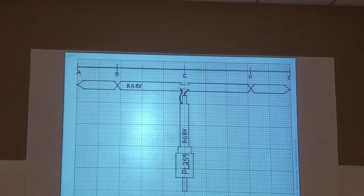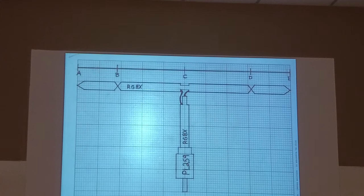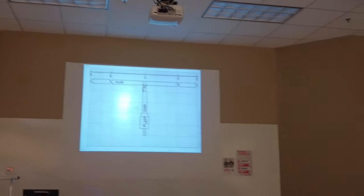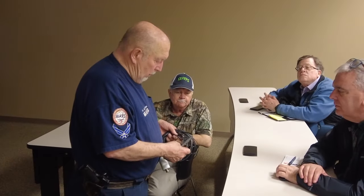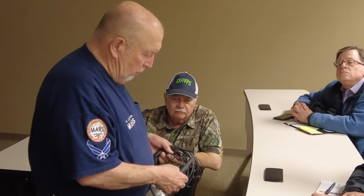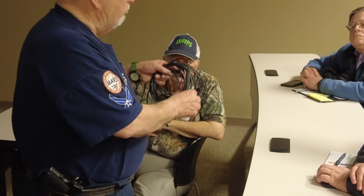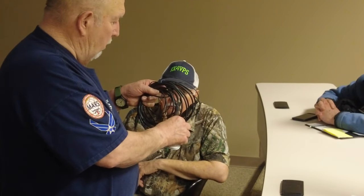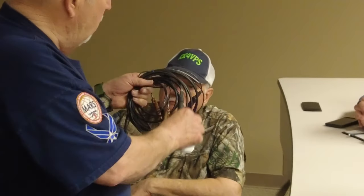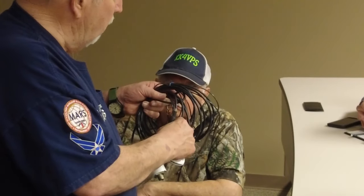And what you saw here, and like I say, if everybody wants it, we'll do a construction class. This is just a little piece of PVC, like half inch or something. And I block up the end after I get everything. I just stuff something in there. And then I poured fiberglass resin down inside the tube. And that strengthens that connection of where I twisted this wire at the end of this one. And then I just covered it with a piece of heat shrink. So that works really well.